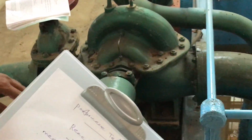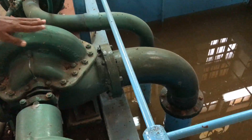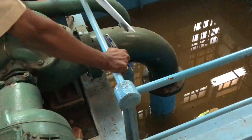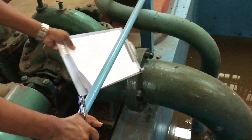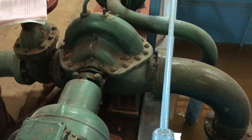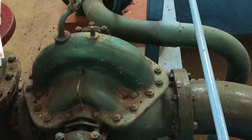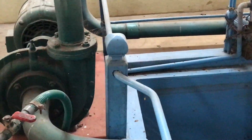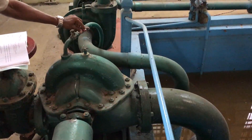Here, water is taken from the sump — there is no dam. A pipe used to carry water from the sump to the inlet is called the suction pipe. This suction pipe is a huge diameter pipe. Before starting the centrifugal pump we have to prime it by pouring water. Since it is very difficult to prime, we use a smaller centrifugal pump to do so.